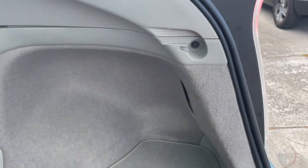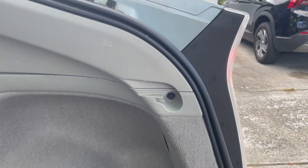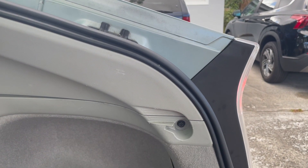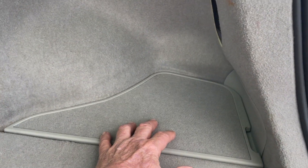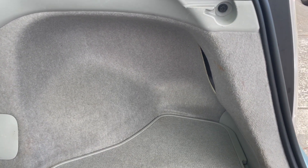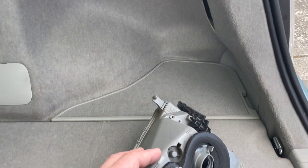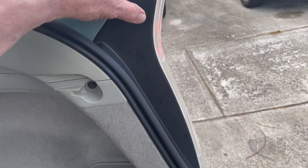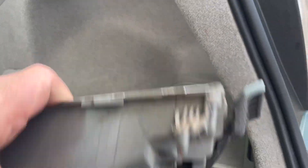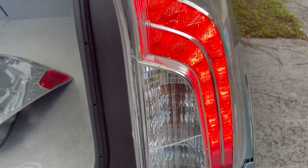In order to do that, there are a few videos on YouTube that explain step by step. You remove this screw with a 10 millimeter socket wrench — this one, this one here, this screw — take out this plastic and this one, and just push the cover to have access to the tail light assembly. You have to take out a nut from here and a nut from there, then push it out. Be careful because on the bottom of the assembly you have a piece that is underneath the bumper, so be careful when you remove the whole assembly.